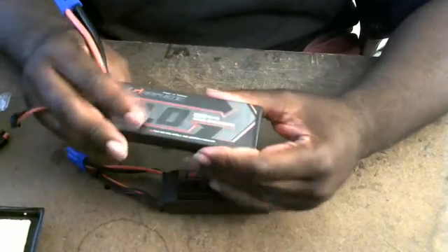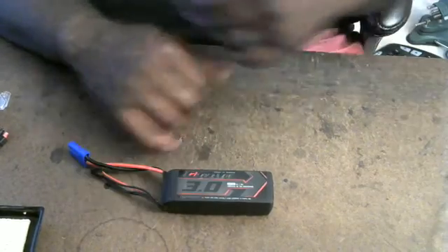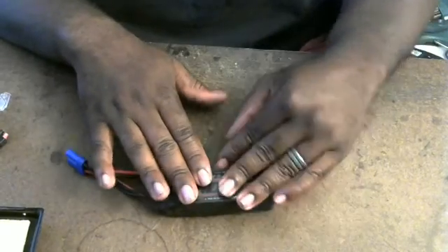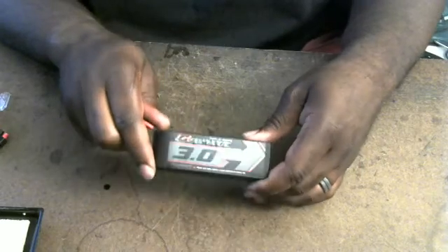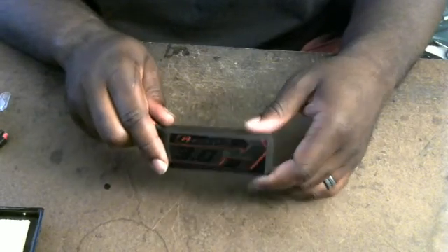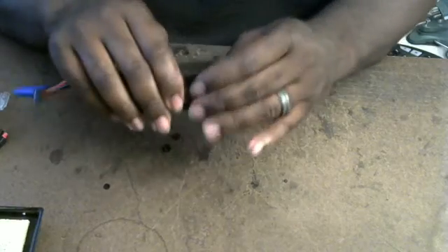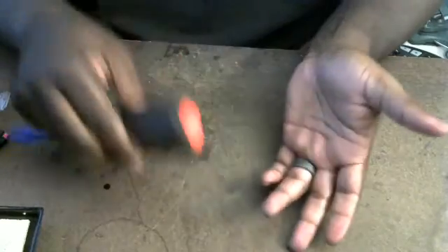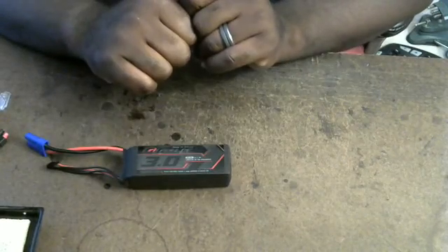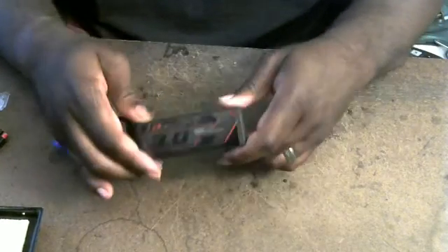The cell warmed up, the IR went down, and it performed great. On the 5C and 10C discharges of this 15C pack, it was warming up quite considerably — getting up to 55 to 60°C, and then after the discharge stopped, going up another 5 or 10°C. These packs were getting extremely hot, and yet this pack is still firm. Nothing squishy about it, so it should be performing as it should.